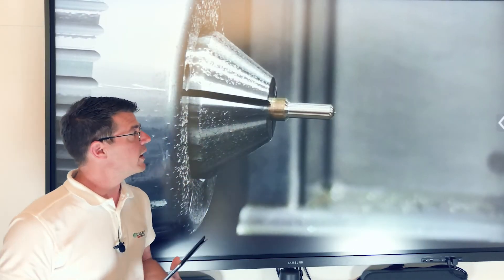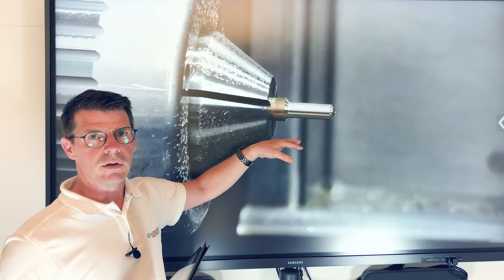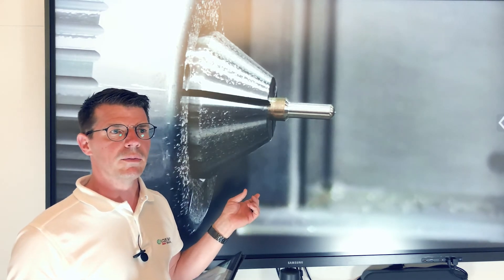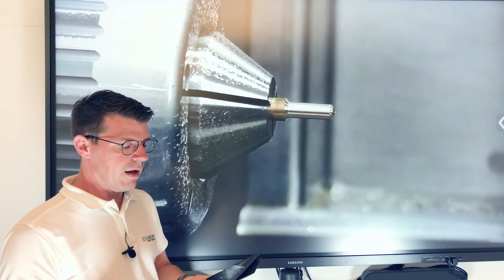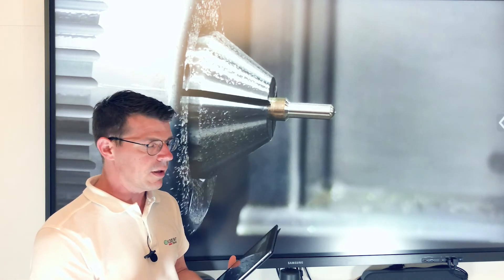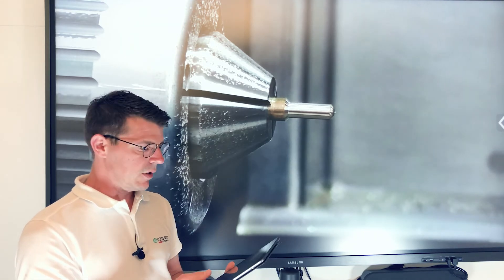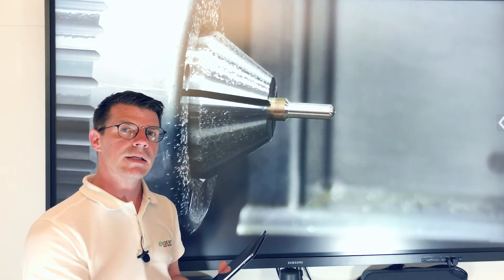Here I will show you the realization and machining of one of these parts. This one was made on a brass part in order to see everything clearly, because we could make it without any coolant. The rotation ratio between the part and the cutter is one to one, and it was turning at 750 RPM. The cutting speed was at 95 meters per minute, the feed rate was at F7, and the last pass was at F0.5 millimeter in order to get a really smooth and nice surface state.